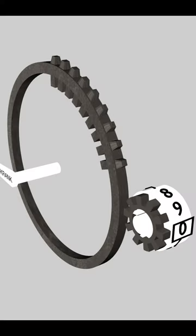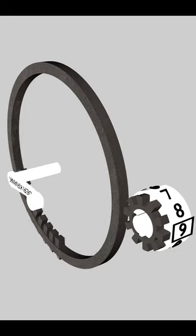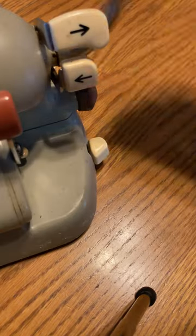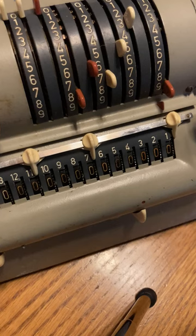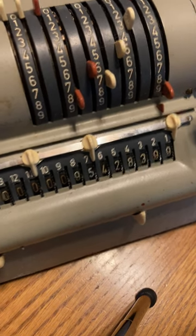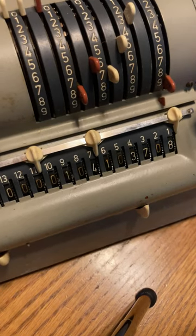And they act like teeth on a gear, so when you turn that crank, it'll add in exactly how much you wanted. And since the crank goes all the way around, you can do it over and over again to multiply. You stack a bunch of these next to each other and add carrying mechanisms from one to the next, and you've got a fully functioning pinwheel calculator.